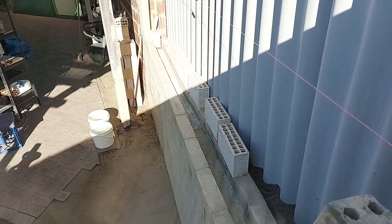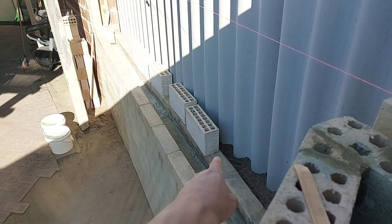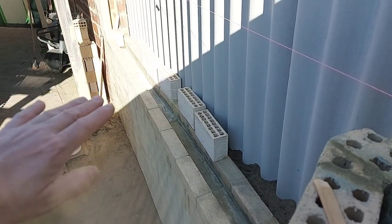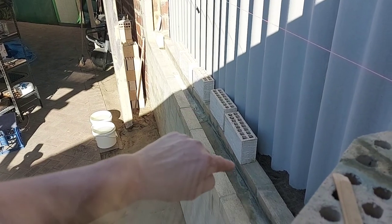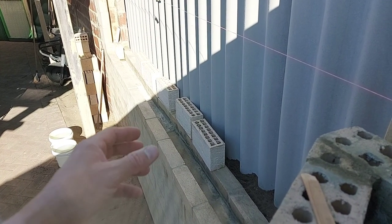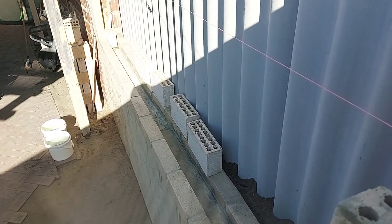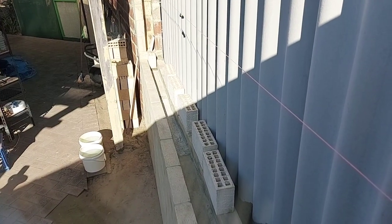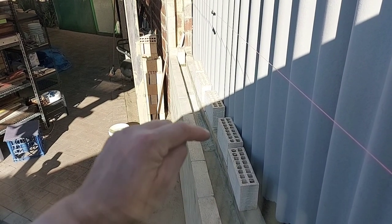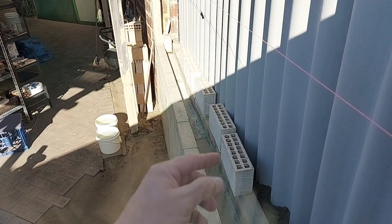The top gets rendered over and screeded up, and I'll talk about the reasoning later. Because of temperature differences — that outside wall will see the sun, that inside wall will never see the sun — you've got to make sure this doesn't crack. Every bit of cement poured over the top of the limestone rubble is a very soft mix, like 15 parts sand to one part cement, pretty much the same as what you have at the base of your bathtub. If that was a hard mix like mortar or concrete, when it heats up you'll end up with a fracture right through your wall.